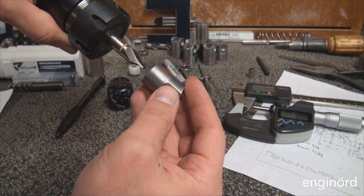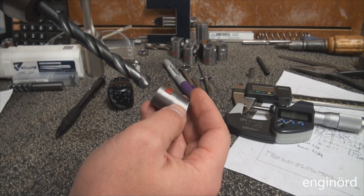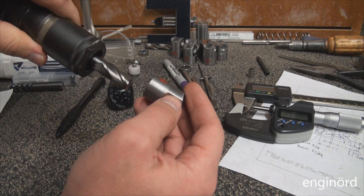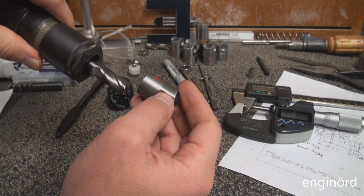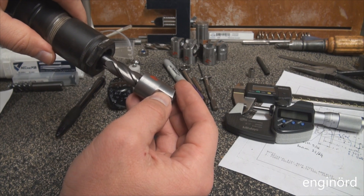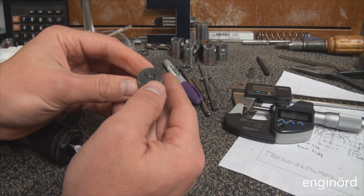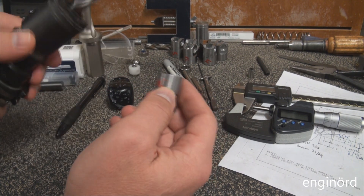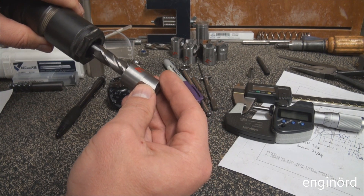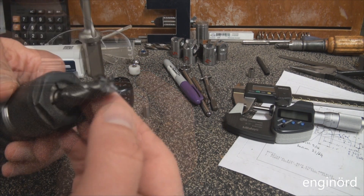My initial thought was to come in with a spot drill first, then come in with another drill to drill the hole to a certain depth. The next operation would be to come in with an end mill to deck the length and also create the bore, the cylindrical bore. But after doing a couple of pieces that way, I realized I can just plunge in the end mill - go right in, deck it and then create the socket with the end mill.